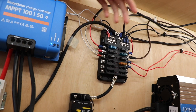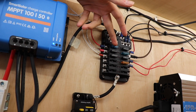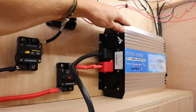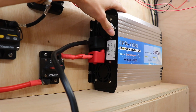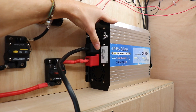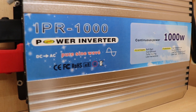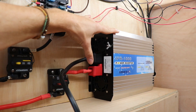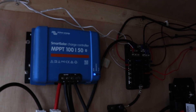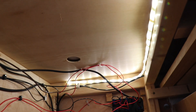You also need to make sure that you fuse your devices appropriately so that if there was a surge of power it would trip or break the fuse before it damaged your device or caused a fire. This inverter here is a 1000 watt inverter. The reason we have one is because there are some devices we can't charge on 12 volt, such as our laptops and occasionally a blender. It takes the 12 volt electricity from your battery bank and converts it into household 230 volts, so whatever you'd plug into a household socket you can now do using this. It's a lot more energy-heavy and less efficient, so try to minimize its use. I also added some LED lights so I could have bright lights when coming into the garage in the dark. I know that can be a bit confusing, so let's jump into my wire diagram where I can better show exactly what's being used and how it's wired up.